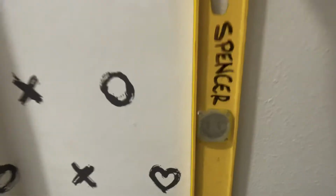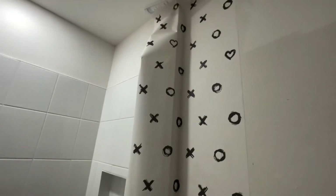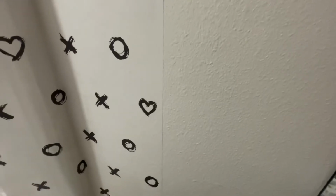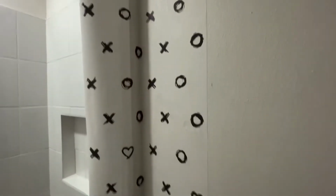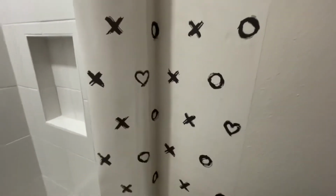This line that you're looking at here will determine where the corner falls. In other words, you might say, well, where do I make the determination about what wallpaper falls in that corner? There's your answer right there, your plumb line. Okay, we're not using that one over there because it's not settled yet. The wallpaper has not been landed, literally like put down. And so we will determine what this plumb line being straight does to our corner.